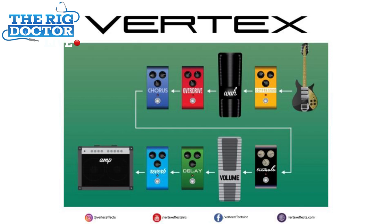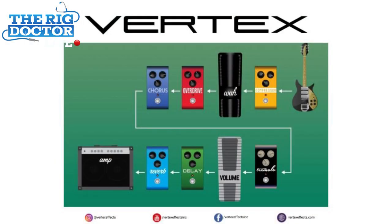Basically, the thing that I've been touting in a lot of the videos that we've put up is the need for high quality buffers, which there are very few of. There are lots of companies that make something called a buffer, but its effectiveness at doing that is actually not that effective. What I encourage all of you to look at when evaluating their efficiency is that a buffer should be a one-to-one amplifier. Whatever goes into it, it should represent that going out of it, so long as you're not turning on another pedal. Presuming that everything in our fictitious signal chain here is true bypass, it should sound the same if it's properly buffered as if that guitar were plugged into the amplifier with nothing else in between.